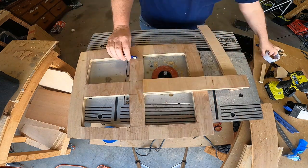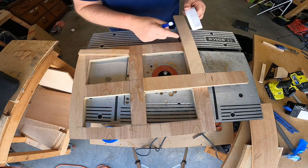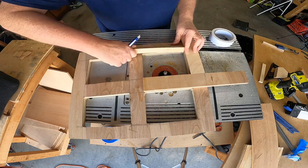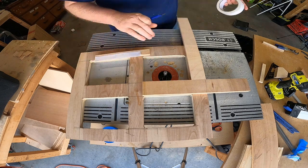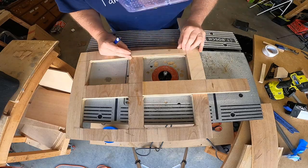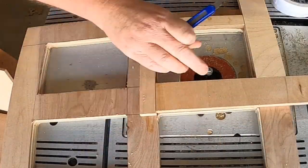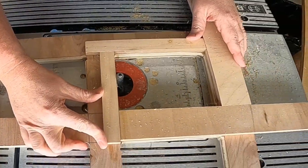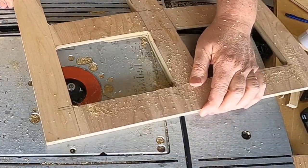The process for making a window brace is pretty straightforward — it's just time consuming. I used a jigsaw to rough cut the windows. If you do a good job with a jigsaw you can stop there, but I wanted things nice and smooth. So I used some straight pieces of scrap and double-sided carpet tape to make a frame around each window, then used a flush trim bit on the router to get nice straight lines. I followed that up with a round-over bit to smooth out the airflow around the braces.